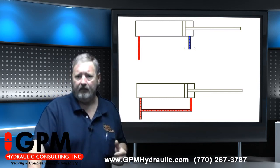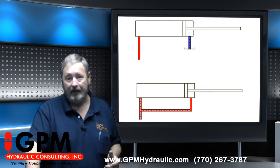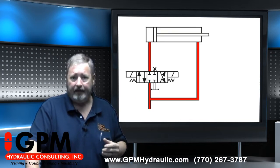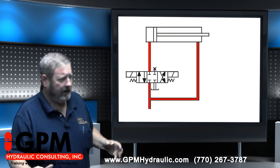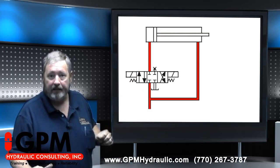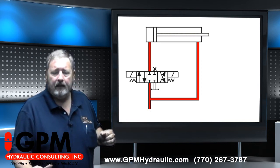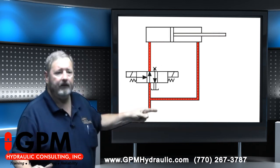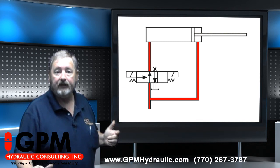Right now we have a problem with both of these cylinders, don't we? We can extend both of them. We can't retract either one. So typically they're going to be connected more like this, using a directional valve. And you see that our A port is connected to the piston side of the cylinder. The B port is plugged off.